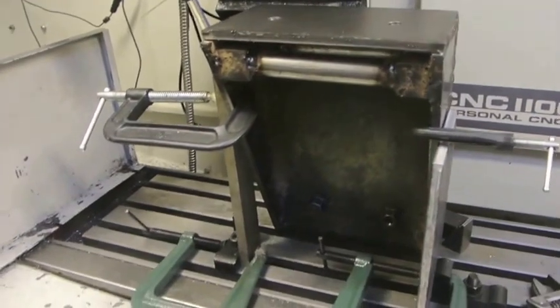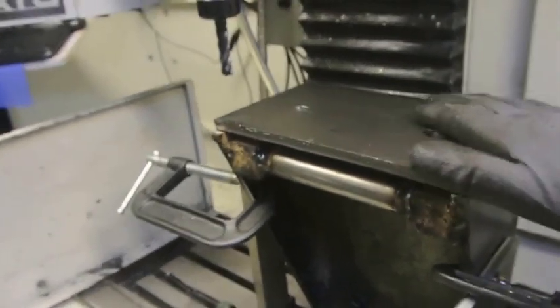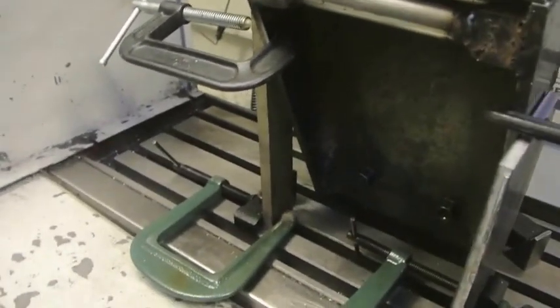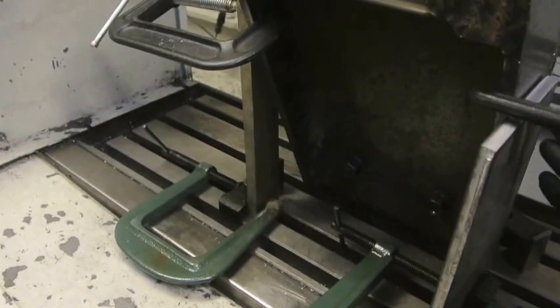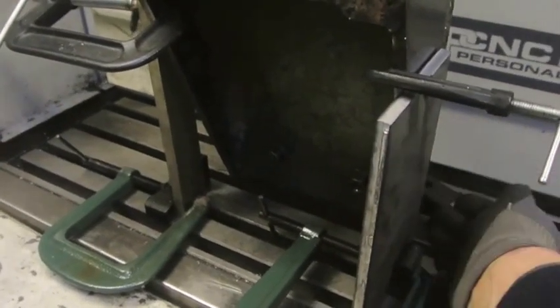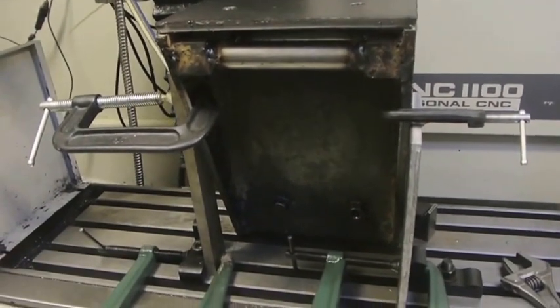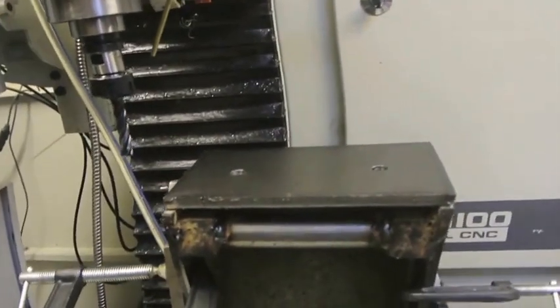Well, here we see the setup for the next phase of the operation, which is to machine this face here. I'll just take this plate out of the way. These are just added to give the whole setup a bit more rigidity. I haven't got a decent angle plate to bolt this to. I'm using once again my 5C collet holder with a vertical face, through-bolted from two holes in the back. So I'll go into Path Pilot and we'll set up to run a facing cut across here and dress that off.